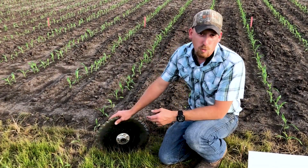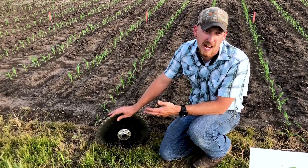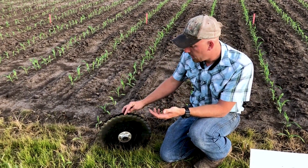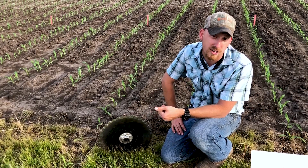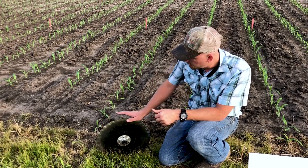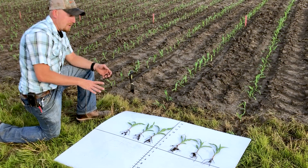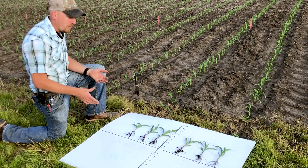They utilize their own hub, which they say is stronger — it's definitely wider than a stock hub, and that helps create less blade deflection. So we won't have as much blade flex with these openers compared to the standards. I also believe they're a little bit thicker; they're pretty heavy blades. It'll be interesting to see the longevity of them. Of course, we're never going to use them enough here to know how good they're actually going to be longevity-wise — it's kind of like the poly closing wheels. We're just using it for small plots. So let's go ahead and look at some plants. I would say after digging behind the STPs versus the standards, the trench is probably a little bit easier to dig with the STPs, though that's objective — that's kind of my opinion.